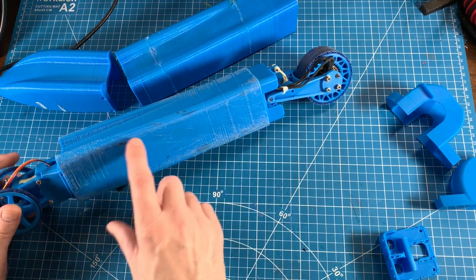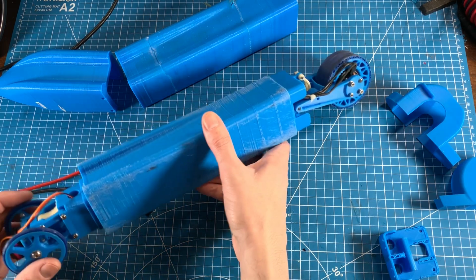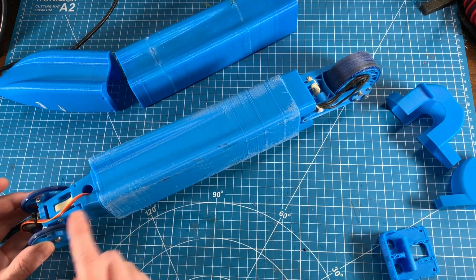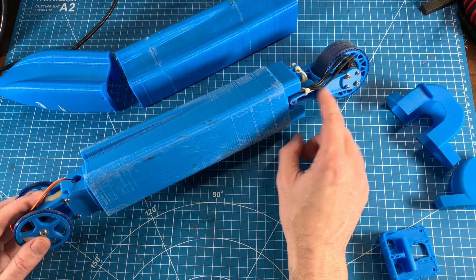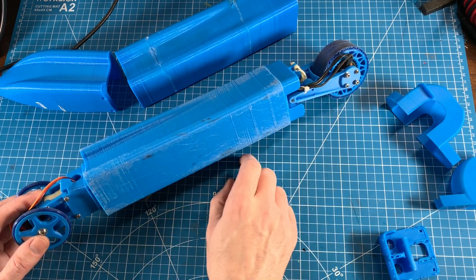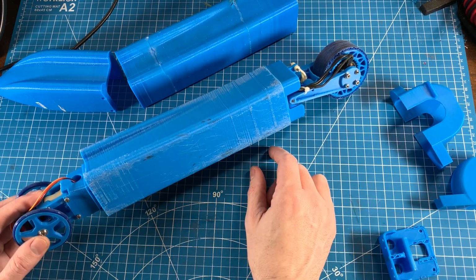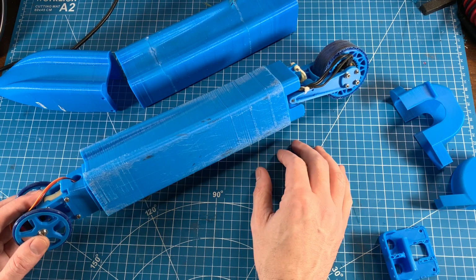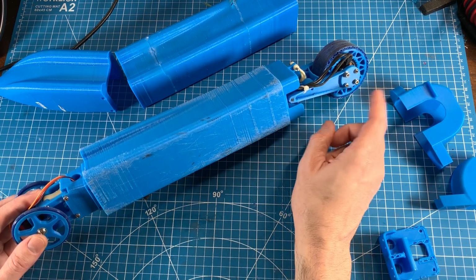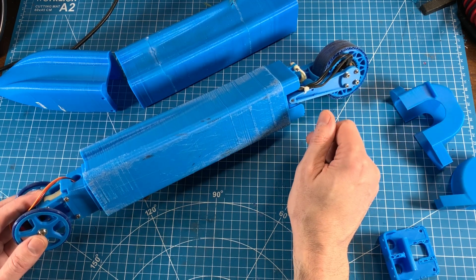I'm going to have an MPU 6050 integrated with a microcontroller up front here to provide gyroscopic stability so that I can counter steer with the front tires, as well as I'll set essentially a maximum acceleration rate, so the maximum number, like a maximum G load that I feel that the tire can always give me, so that it won't be able to spin out. Later on, I might get more sophisticated and actually put a Hall sensor in here so that I can set it to have a certain amount of slippage so that I can maximize my acceleration.